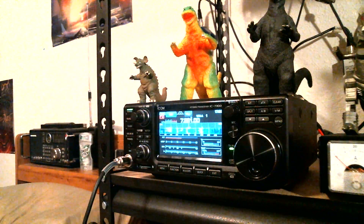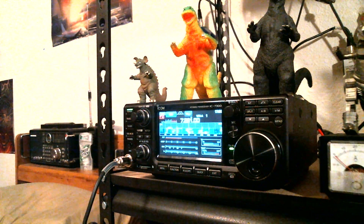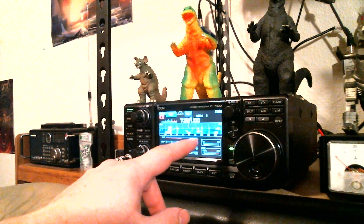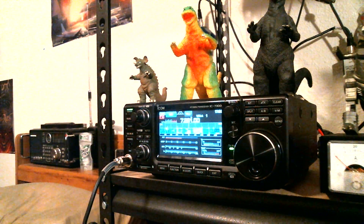So once that comes to an end, the band should quiet down. Maybe I'll try getting on the air. But my antenna is surprising the heck out of me — it actually tunes up on 80 meters. Whereas my fan dipole, surprisingly enough, it didn't tune up on 80 meters. The fan dipole would tune up on 40, but it wouldn't tune up on 20 — it would on 17 and 10 meters. That antenna is gone now, and we have the inverted L. As you can tell from the band scope receiving, I'm picking up a lot of stuff.